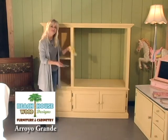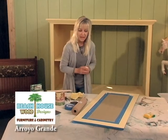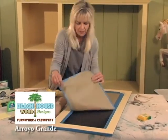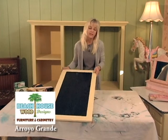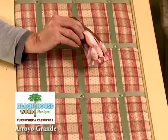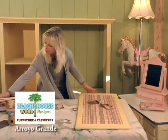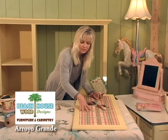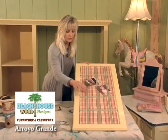We've got everything on, doors on, with a few details to add to make this a very special place for a very special little girl. We're going to reveal the chalkboard paint that we started with underneath here — that was a total of three coats. And voila, there it is. On the back side of the chalkboard, which will be the exterior, I've created a little memento board with fabrics, ribbon, and tacks. It started with a little piece of Luan cut to fit the insert of the door, then covered that Luan with fabric, used carpet tape — Rhino Grip — to adhere the fabric to the Luan board and put it on the door. Then I ran the ribbons, attached those with carpet tape, and the tacks hold everything in place.